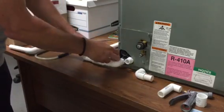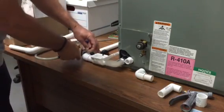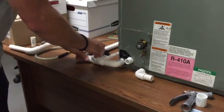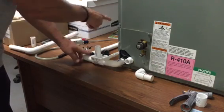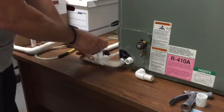To clean out the drain line, remove the switch by lifting up, pulling it out, and setting it aside. The device comes with an adapter that allows you to go right inside the device. Now you can vacuum out, blow out, or flush out the line in either direction — you can also vacuum out the pan, anything you want to do.